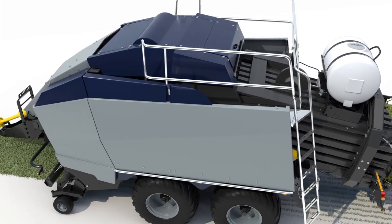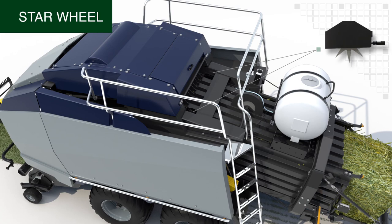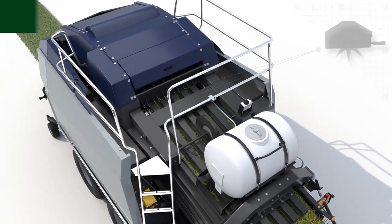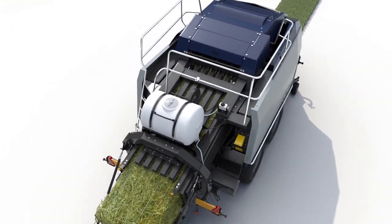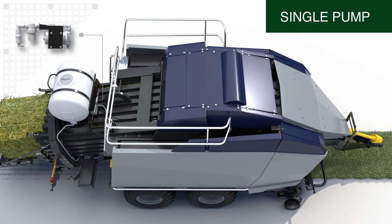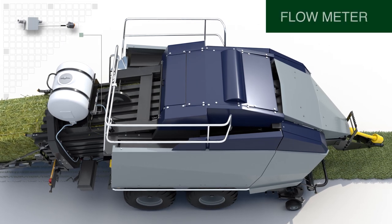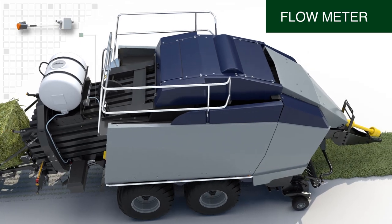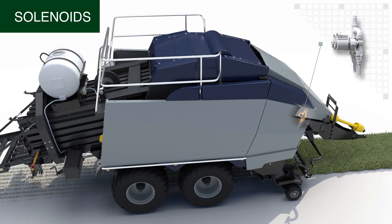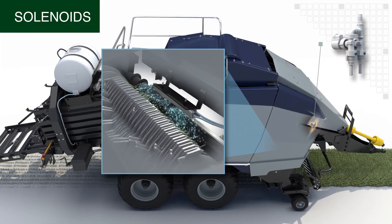It's been enhanced from end to end with high-tech, reliable precision components, beginning with the highly accurate star wheel moisture sensors that use side-to-side reading technology across the full width of the bale. At the same time, a built-in star wheel encoder computes a more reliable baling rate. The single pump replaces multiple pumps in earlier systems, offering improved response, less maintenance, and greater reliability. The flow meter accurately tracks high amounts of preservative the system is capable of handling. Dual pulsing solenoids accurately control the rate of preservative in a range from 24 pounds per hour up to 800 pounds per hour.